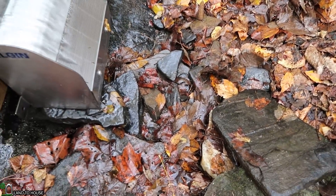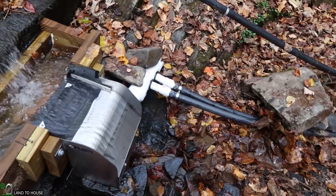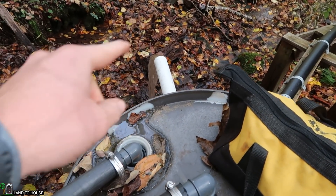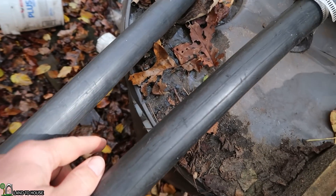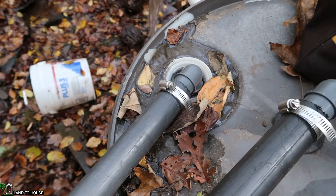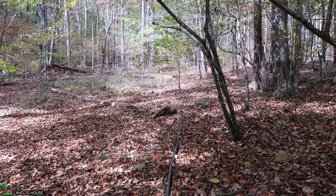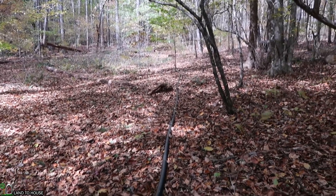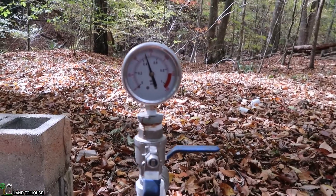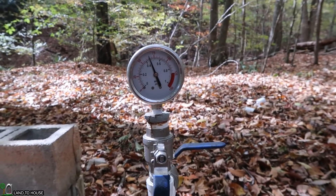It'll be nice to keep some water in the creek in this little section right here until we get down to the barrel. That slight increase of water was just enough to be too much for a single inch-and-a-quarter pipe. And there is just a tiny bit of overflow happening here outside of the input holes, which is nice — that just shows that we captured just that much more water. 1,100 feet of 2-inch poly pipe drops 150 feet of head pressure down here to my actual turbine. Let's see what our pressure is at the moment — we've got about 65, I believe.